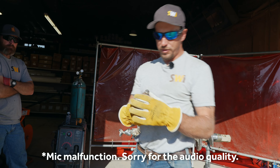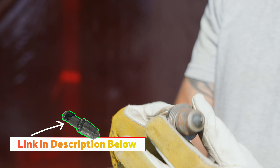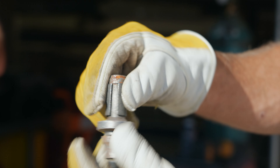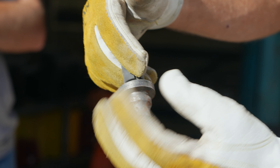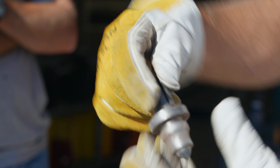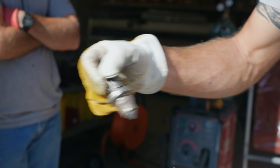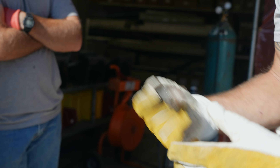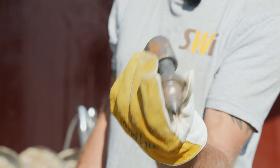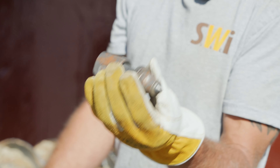Here's one more tooth — this is a rock auger tooth and it goes in a rock auger. I don't have the auger with me, but it's designed with a little collar around it so that the tooth can spin freely. As the auger is turning, this tooth is just sitting there chewing away on the rock, however big it may be. That's the kind of socket it goes into, and you punch this one out from the backside when it's worn out.